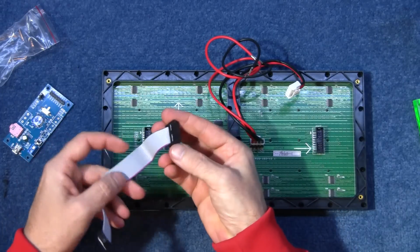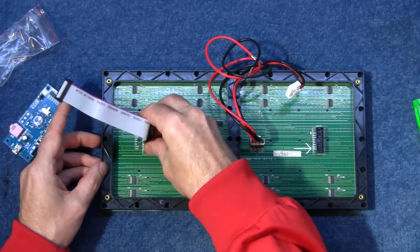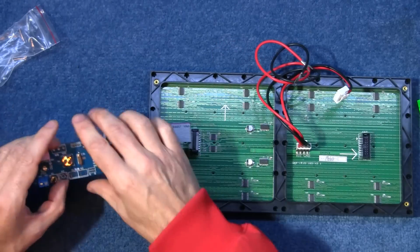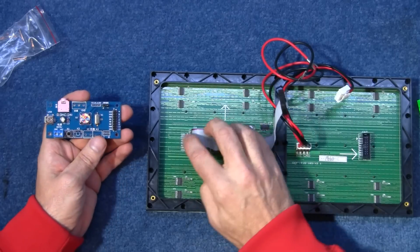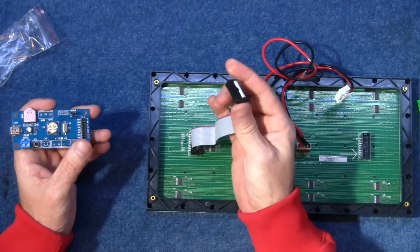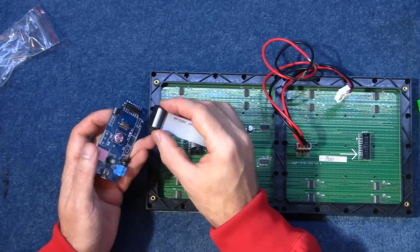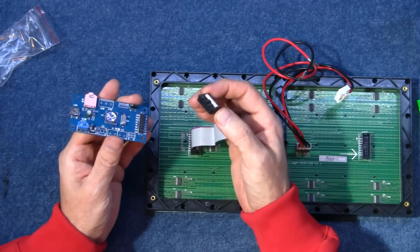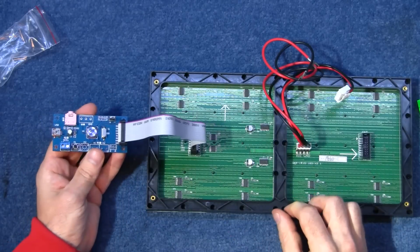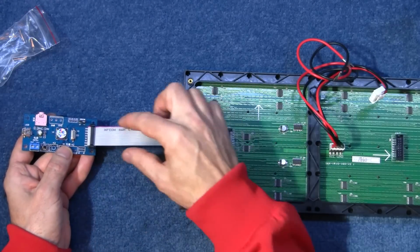And this is pinned. It's got a little plug there, so you can only put it in one way around. So that's going to go into the in. It just says in on there. And this will... Aha, let me just check here. All right, ground, top left. So if I keep the plug the same way, then the ground's going to be the top left. So that means, because there's no keying on this set of pins here, you could put it on any way round, which would be disastrous if you get it the wrong way round, I guess. So I'm hoping that is correct. So it'll sort of come off there and into there like that, if you're going to make one of these up, with the red one to the top.